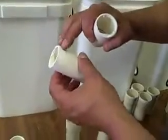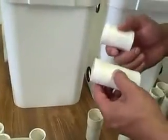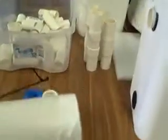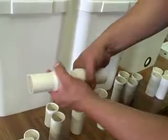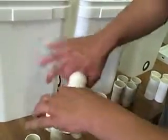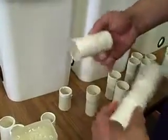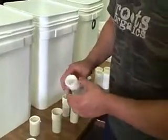Now you can see on these what I'm sure you're wondering about — this is Teflon tape. The reason we use Teflon tape instead of other substances is because it makes a watertight seal and it still allows you to connect and disconnect it. Now if we were to actually glue these pieces — and we tried this, we tried it a bunch of different ways — if you PVC glue or caulk and seal these things together, you're never going to be able to slide it in on both sides at the same time. You've got to have both bell ends in there and then connect the longer piece of PVC on the bottom by putting it into both bell ends. That's an extremely important point — don't try to do anything yourself, follow these directions exactly.